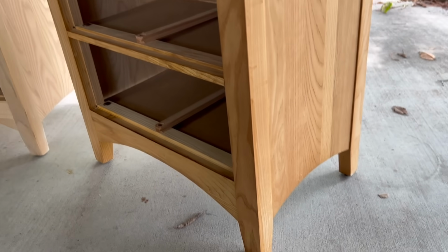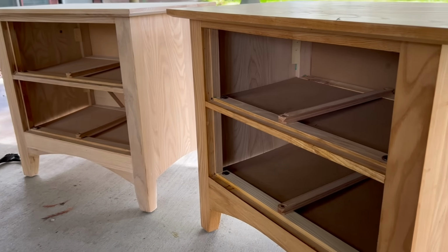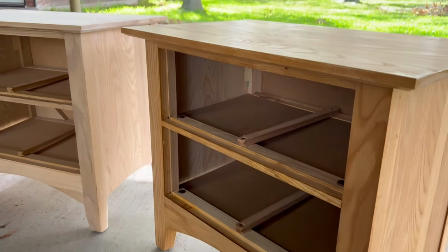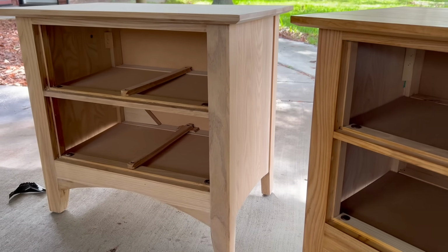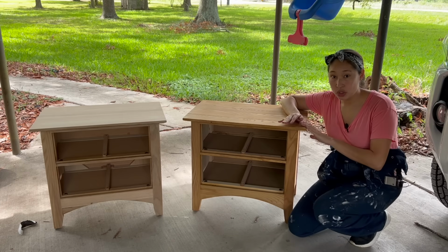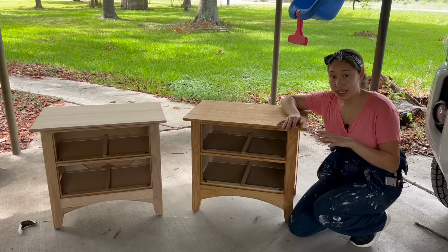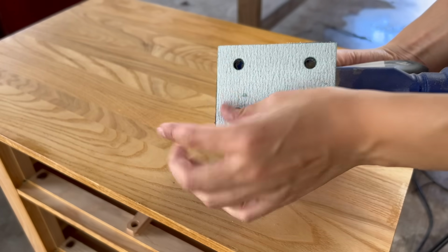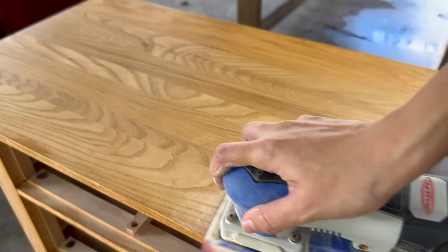And I think this alone just makes it look so much more modern than, again, the old yellow orange that we had here before. So I'm just gonna go ahead and sand this one along with the other two drawers. And then once everything is sanded, then we'll move on to the next step. I began sanding back to raw wood using first 150 grit followed by 220.